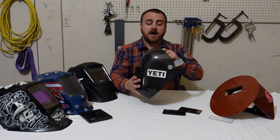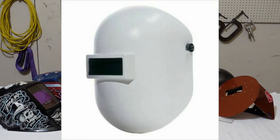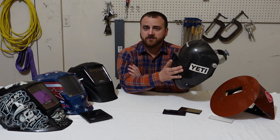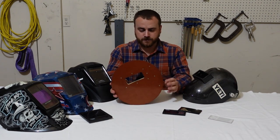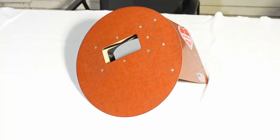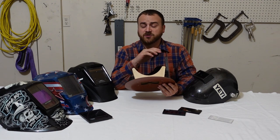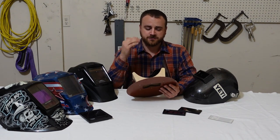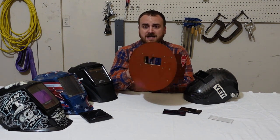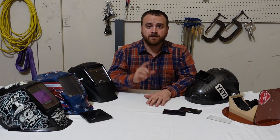In this category, you're going to have a few different options. Like we talked about with the sugar scoop, you can get these from a whole bunch of different companies with all sorts of different designs, different patterns, different features. So this one from Pipeliner's Cloud is made of carbon fiber — it's super, super light, which is why I loved it so much. And then we've got something like this, which is a pancake hood that's again very light, has a lot of protection on one side of your face but no protection on the other. What's nice about these is they have a wooden box on the inside, so if you're doing a lot of outdoor welding you can sand this down to your face so it fits perfectly and no light can get at you from behind you. This is the ideal circumstance for welding outside. But if you don't sand yours down, it is going to hurt your face. So sand your pancake hoods down.